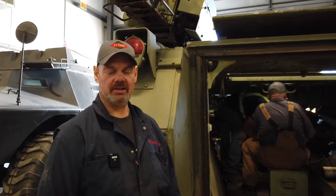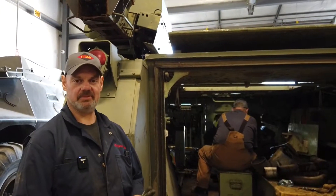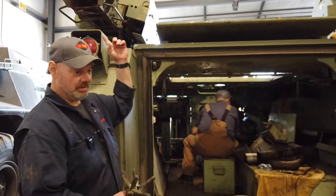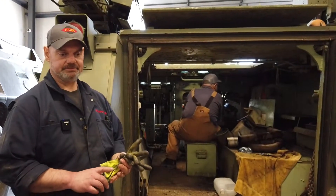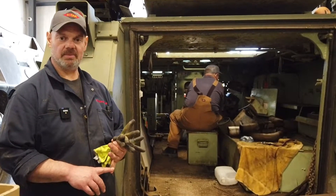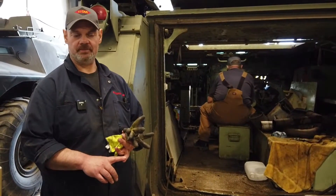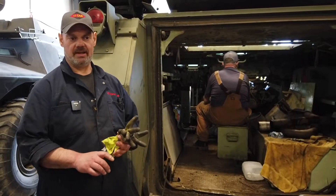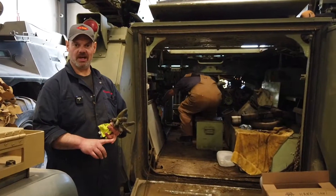What we're working on here at the back side of the engine is the hydraulic pump for the hydraulic system that controls the auger just above me here on the left-hand side of the vehicle, and the dozer blade in the front. The cooling system fan drive needs to be disconnected, the belts off the engine for that, the generator and alternator need to be removed to give us room to pull the engine, and some more linkages that need to be disconnected to the driver's position.